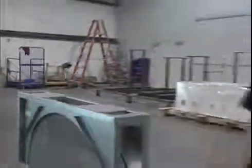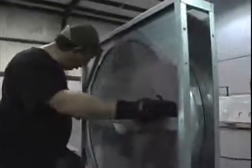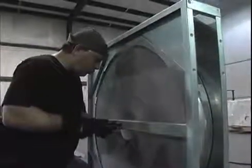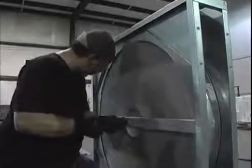And we can go ahead and remove the ratchet strap. We're going to check the alignment in both planes, vertical and horizontal, to ensure that we have the same gap on both faces. We also want to keep an eye on it as we tighten the shaft bolt down, that it doesn't shift on us.